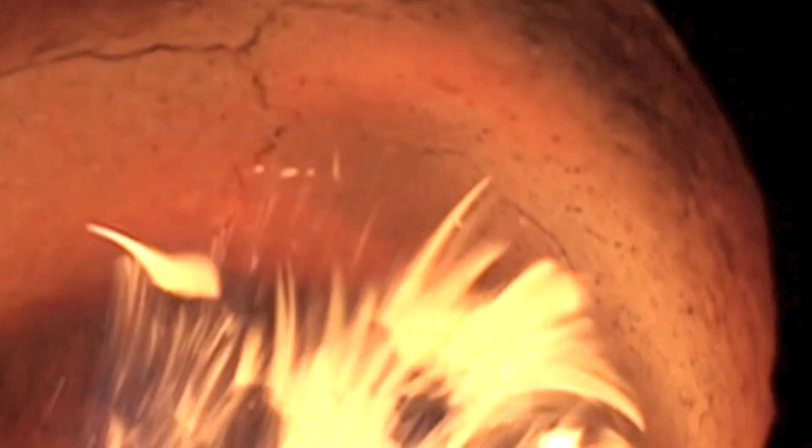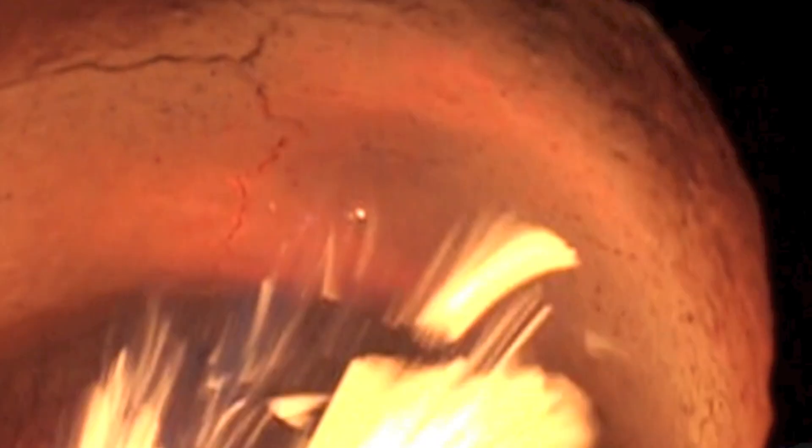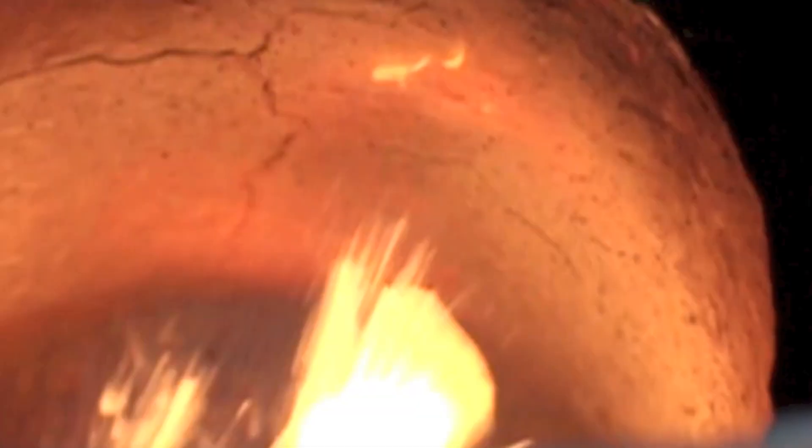You look for the streaks and those little spots, and you can kind of tell that's not a good fire. It's never going to produce the heat you want, and you're probably going to end up with unburned oil in the combustion chamber. I'm going to leave this on so you can watch these streaks. This is probably the most common failure in adjusting burners — people adjust them with too much air because they're afraid of getting soot. But if you adjust with too much air, you are going to decrease the efficiency pretty massively and won't completely burn the oil.